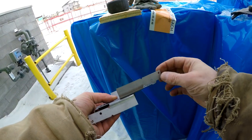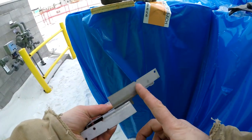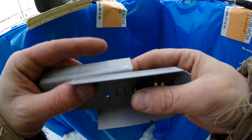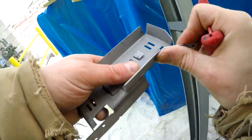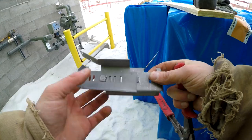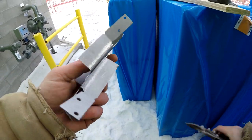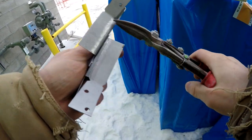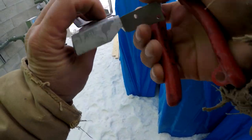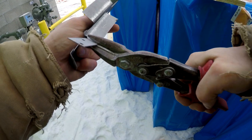I'll cut these off as well because I like to screw through the stud this way, and when you wrap these over it's harder to get the drywall in. These are the little clips that usually wrap the stud, but I always cut them off. I only use them if I don't have access to the inside of the stud, which I'll show you in a sec. You just clip them off right there.